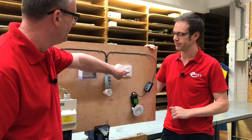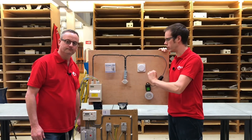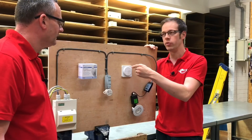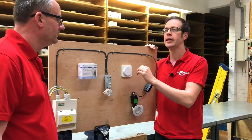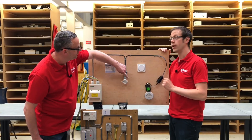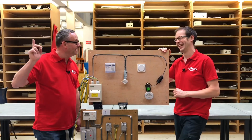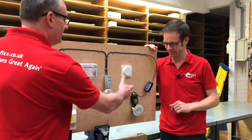Can you just remind me what we think is going on inside this switch? I believe there's a device in here taking the kinetic energy of the switch movement — as you push the switch, there's a bit of movement — and it's using that kinetic energy to generate a very small amount of electricity, which is enough to send a signal to the receiver over this distance. So I'm going to send you on a little walk. I'll stay here, and we'll see how far we can get you away and still operate the actual load and turn the lamp on.